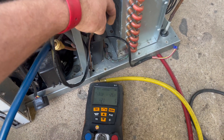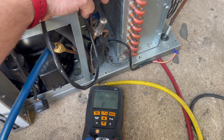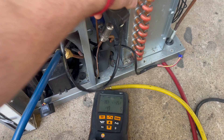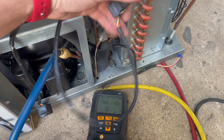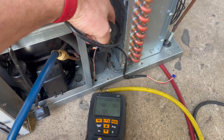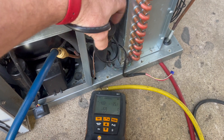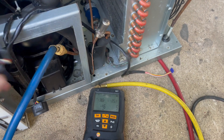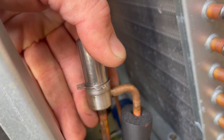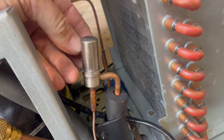So with this we could just set the superheat on the system manually just to get us out of trouble. On this one I think we had either broken thermistors or control board or something that was controlling the EV valve. So we just had to get the client out of trouble and we just opened and shut it, set their superheat and away it ran and it ran perfectly — could have probably done without it.